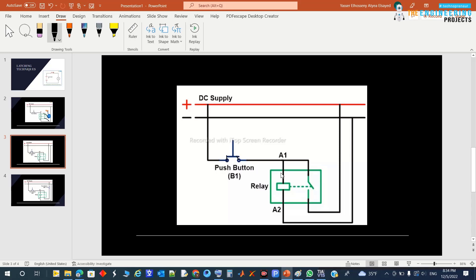By pressing the push button the first time, the coil energizes, the circuit closes, and the motor receives power. Now even when you release the push button and open that circuit, there's no problem — because you've guaranteed another path for the coil to have power through a parallel contact, keeping the relay contact closed forever.